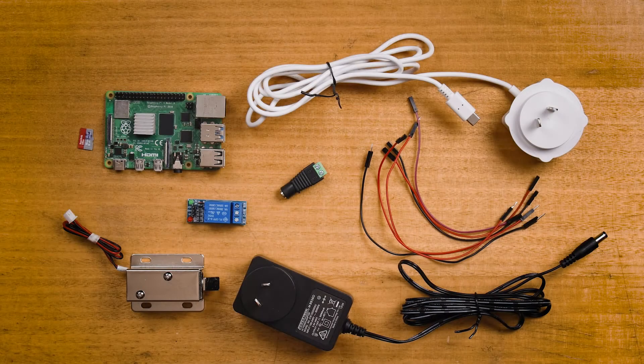On the table is everything you need to make it work: a 12-volt solenoid — I'm using a latch solenoid in this case — and a 5-volt single channel relay module at 10 amps. While marked as 5 volts for input signals, we found this works fine at 3.3 volts, which is good as it's the max voltage a Raspberry Pi GPIO pin can output. You'll also need a Raspberry Pi with a micro SD card flashed with the Raspberry Pi OS.